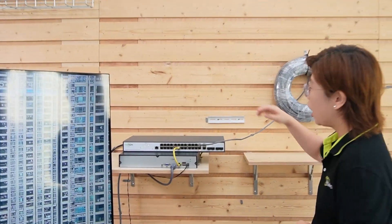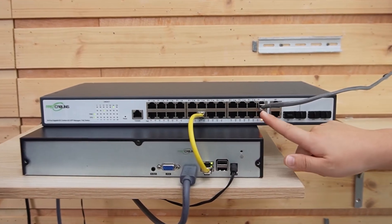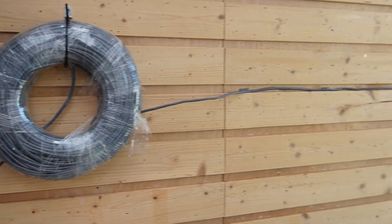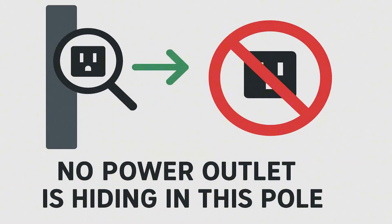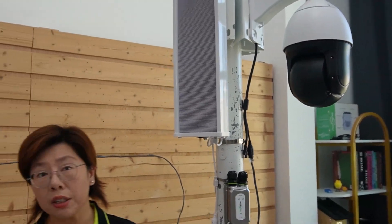Let's start simple. The switch is connected to an NVR to display video, and we're connecting a 100-meter Ethernet cable, sending power and data from our switch directly to the PTZ camera. There's no extra power brick hiding in this pole — classic PoE camera install.